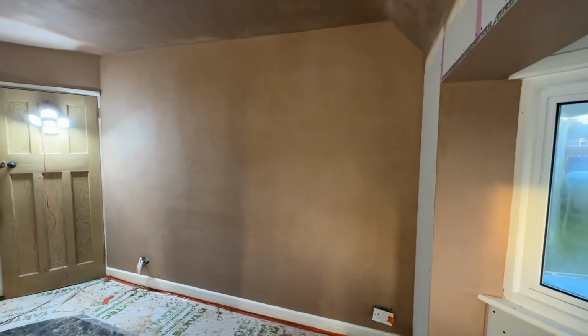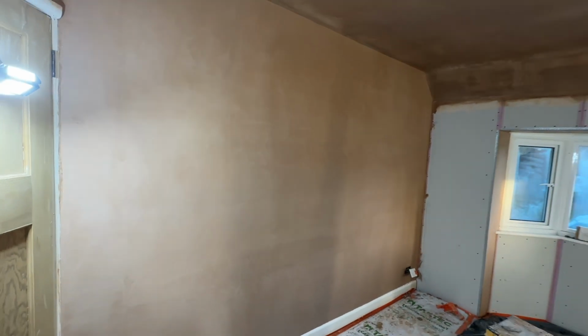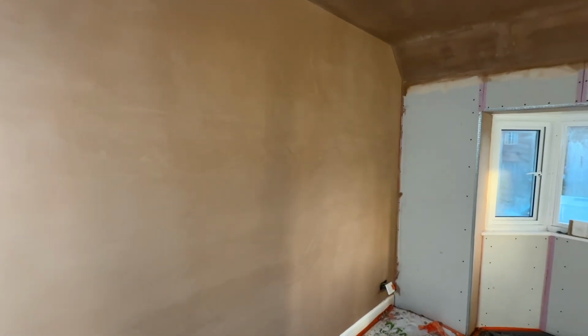This has just had a good dry trowel. You can see there, that wall now is not only fully meshed, because it was a bit of a cracked one, but that also enhances the impact, or increases the impact resistance. So that is one way to make a wall much stronger as well.